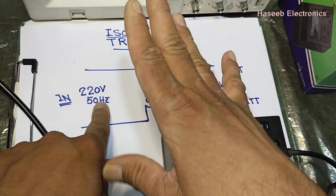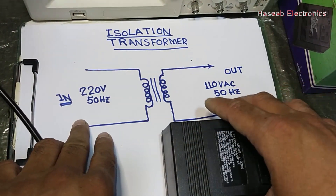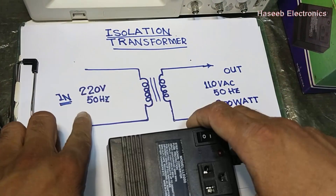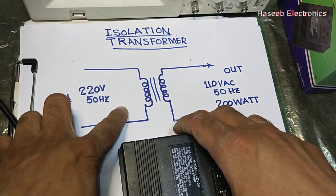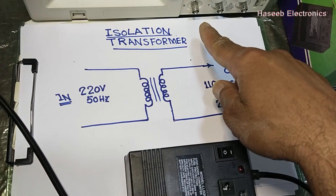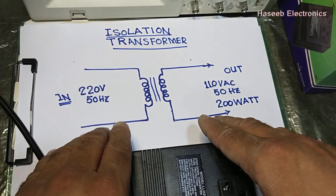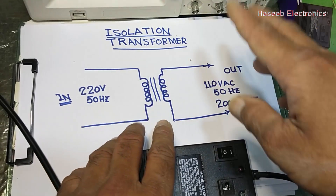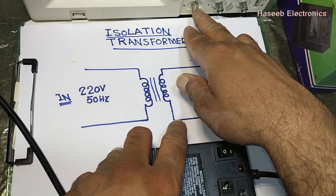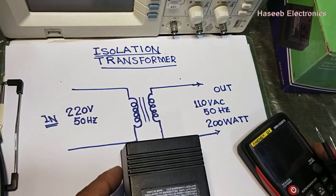to isolate the test equipment from the main power. That is the best safety practice for equipment safety — for our oscilloscope and any test and measurement device. We select an isolation transformer so that the direct line voltage does not interrupt the circuit. When testing any signal from an unisolated circuit, this will not damage the oscilloscope. Some oscilloscopes which have no isolation may be damaged by connecting directly to line voltage.